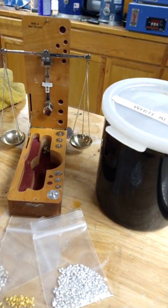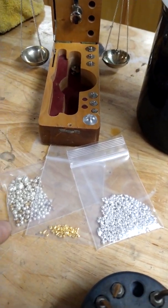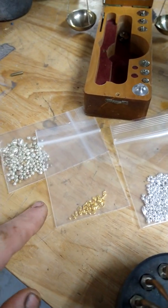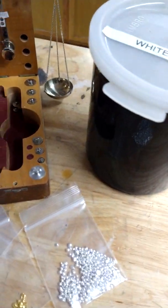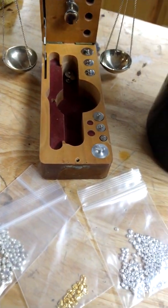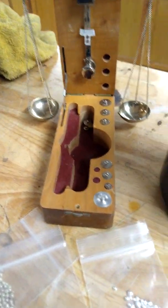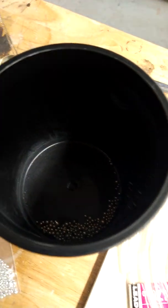Today we're going to be alloying right here, right now, some 14-karat palladium-based white gold. For that we have 999 pure gold, pure silver, some sterling, copper, and a little bit of palladium. We've got a couple of tricks here, and using our trusty grain scale we're gonna get this precise. I have a pre-made, pre-mixed white alloy that contains everything I need to make the 14-karat white alloy, and you could tweak it either for nickel base — which I never use anymore.